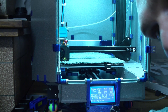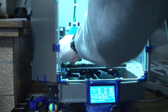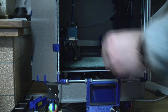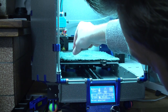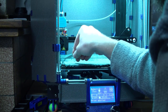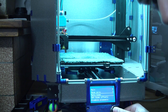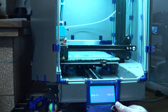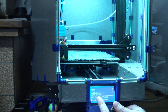One other funny thing. Stop. Okay. Good. Oh man, pieces of carpet are on my nozzle. Don't know if you can see this, but it has carved all the way through this carpet. So that's not good. If I do the auto homing position, I have to move it 5.8 millimeters. That's the thickness of the material. Don't forget to do set home offsets.